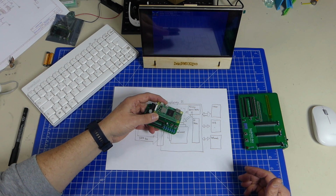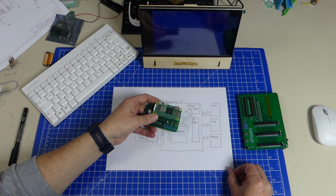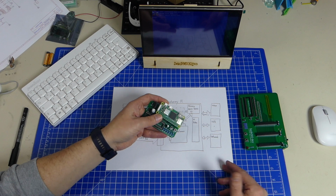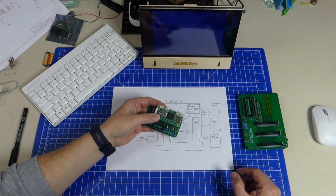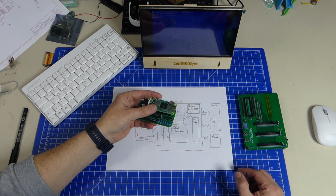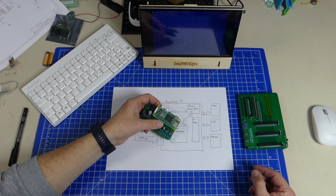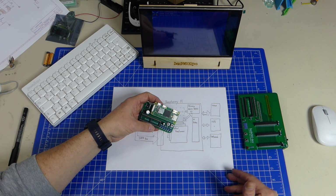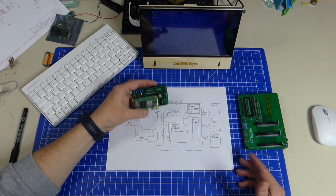There are no daemons, there is no infrastructure, there are no run levels, there's no security, there's nothing. It's basically just your program running on the Raspberry Pi. And it makes this thing behave very much like an FPGA, when you program the FPGA not in gates, but in a high-level library-driven system. This is pretty similar to that. Still different, but similar.